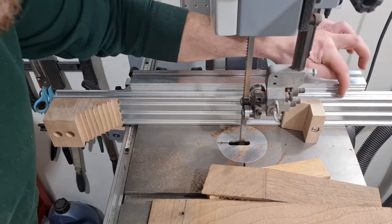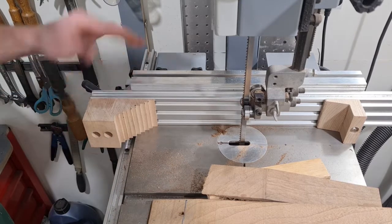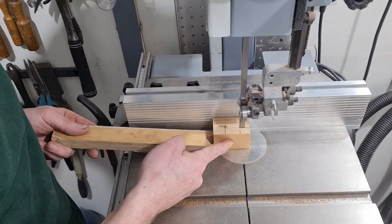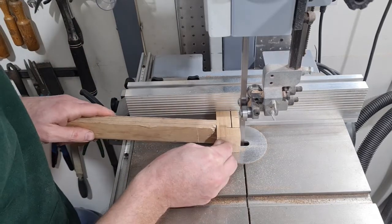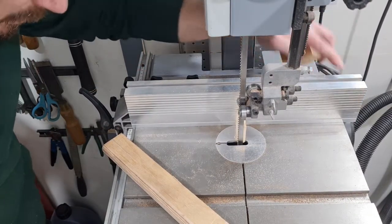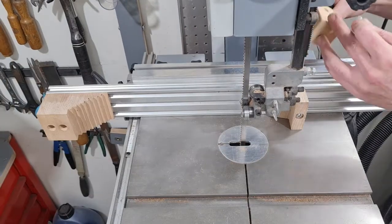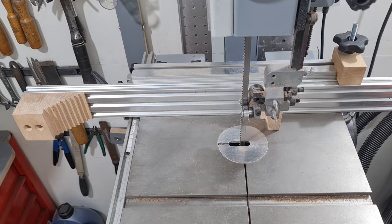What I am going to do is make a little guide for my fence here that sits over the top, so when I get to the extremes of the feed it won't catch and drop off the side. I'll drill a hole down through the top there for the rail bolt — I've got a nice little radius edge on here already — and I'll give these edges a sand. That will support the taper jig. Now with the little stop on there, when I'm at the extremes of extension on the taper jig it can't go anywhere.